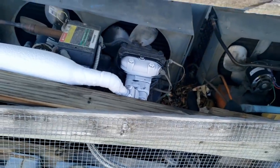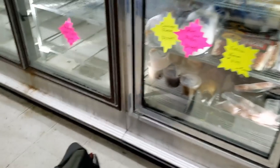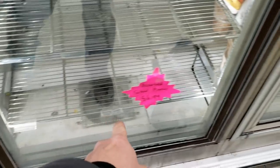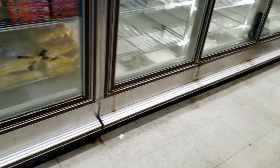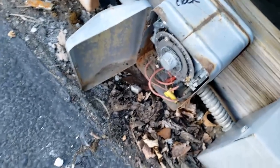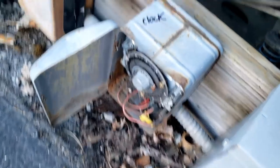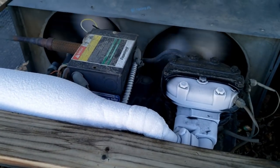It's got the hippy hippy shakes going on there. The one that's on - because the lights are on - is the one we didn't do it to, so you've got a fan out here and out there, one out there. This is on another section - this is the one we just put into defrost, which ended up shutting off all these here. We'll put that one back on, throw the other one in defrost, and focus on the ones actually not working. We just tested the clock - the clock's tracking time - so we'll go ahead and put this one into defrost and see how that does.